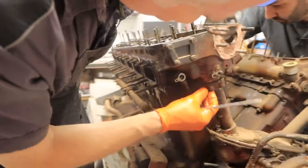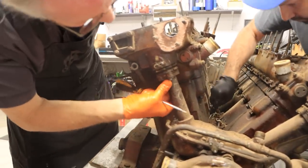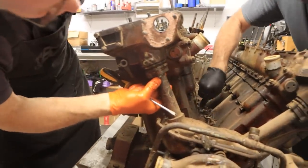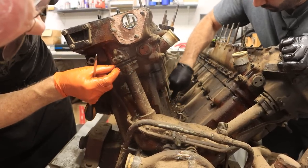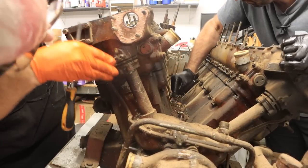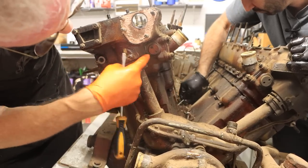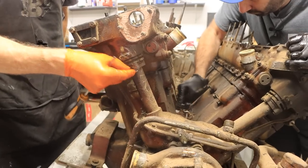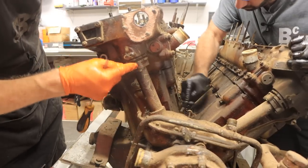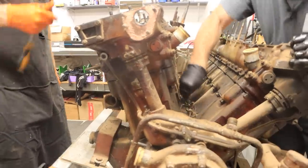This tube is now loose — once I took those screws with the lock tabs out, you can see the outer tube for the bevel drive for the camshafts is just loose there on that face. These two castle nuts were to adjust it — there'll be a tolerance variation, and that adjustment brought it down so it would have sealed on the O-ring or gasket between here — then the screws hold it together.